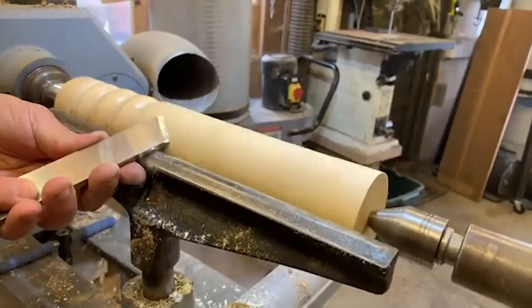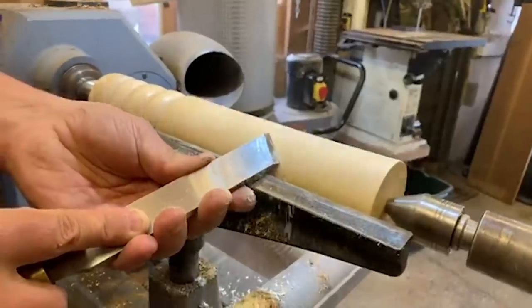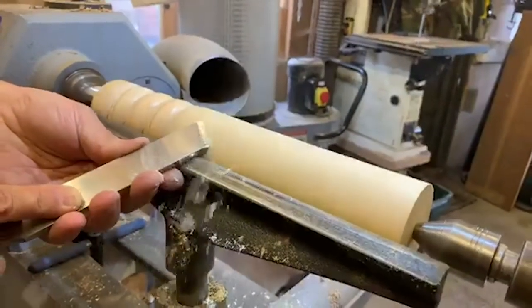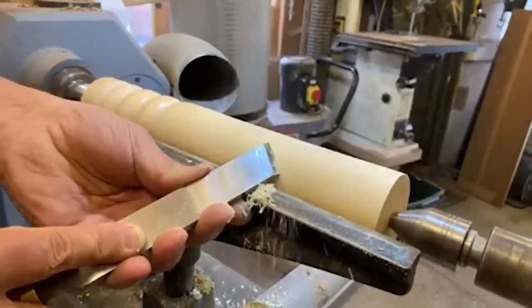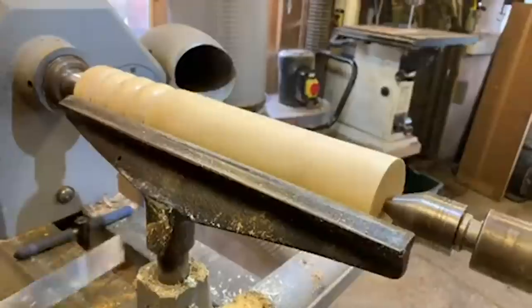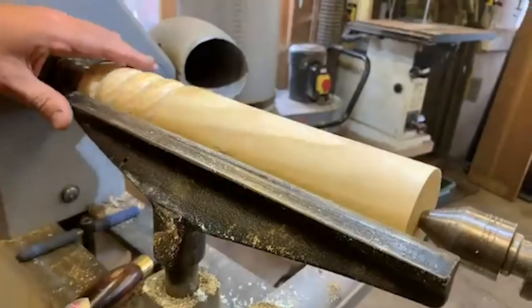So what you've got to do is just back off a little bit. Take a lighter cut. Get rid of your white knuckles, just hold on to the chisel nice and gentle. Let it drift over all those high spots. And then eventually that bevel bounce will all disappear again. That is, if that bevel bounce is down to you pressing too hard, of course. All right, so we're going to do one other thing now. So a light touch will stop your bevel bounce in that scenario.